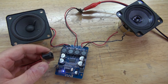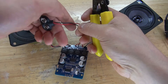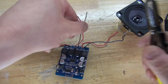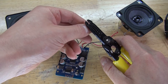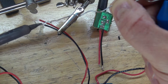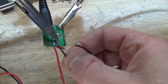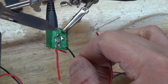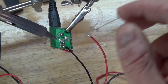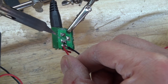Next, I'm going to take this DC input jack and connect it to where the 9-volt battery clip is. Simply cut the wires at the appropriate length, remove the insulation, solder-tin it, remove the unnecessary wires, and then solder the new wires in place — solder the negative to negative and the positive to positive. And there we go, the circuit is now complete.